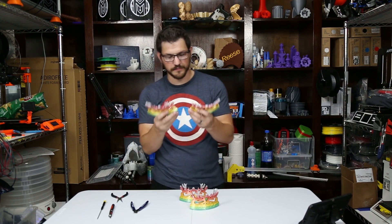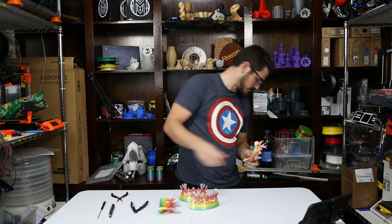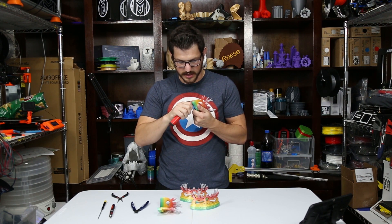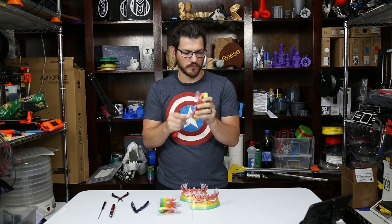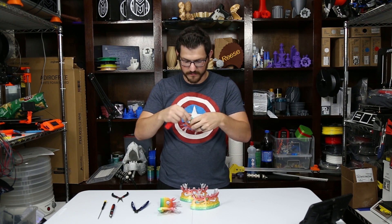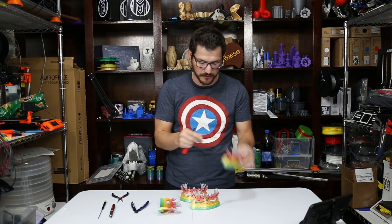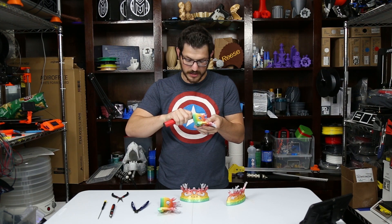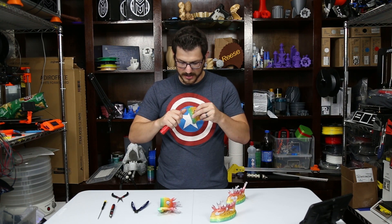Here are all four parts cleaned up. I went ahead and gave them a quick sand so that they're all flush. There's just a little bit of elephant foot on this one that didn't quite get clean, so I'll just take my deburring tool and run it down the side — that takes the elephant foot right off very quickly. These are definitely worth having; they're an invaluable resource for 3D printing. Elephant footing can prevent you from getting a nice clean seal between two parts.